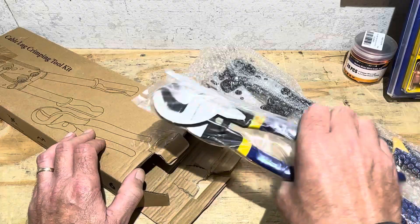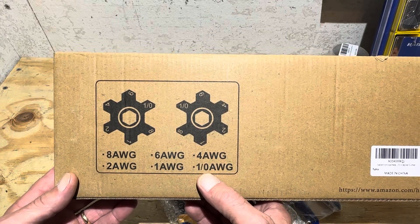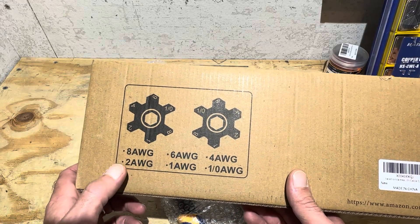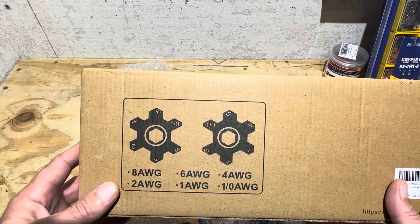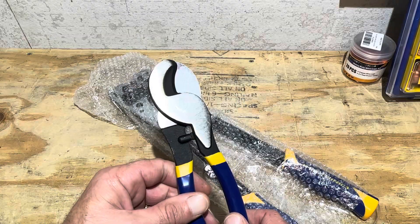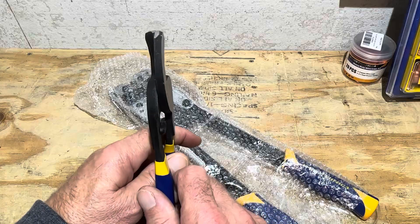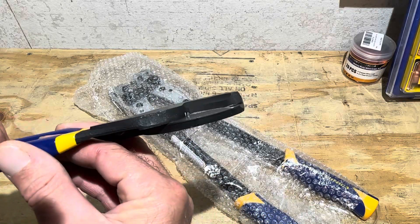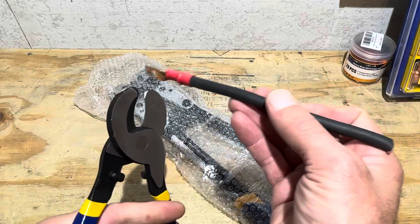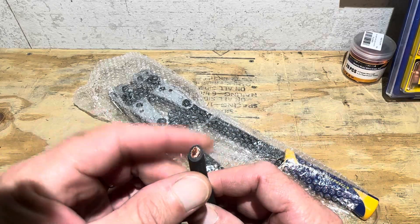There is the crimping tool and the wire cutters that come in the kit. This tool does not do as large of wiring as my hydraulic tool, which will do 750 MCM — this one will do one ought. I've got a big project coming that'll use a lot of two gauge wire, and this has quick-change dies, so it might save some time as long as it makes a quality crimp. Checking out the included wire cutters: the finish is fairly decent, coated in shipping oil. The connection feels decently tight with not much gap between the blades. Testing on some six gauge wire — cuts pretty good. Fairly sharp, fairly good cut right out of the box. Nothing to complain about yet.